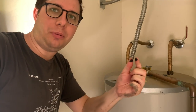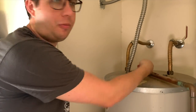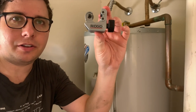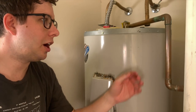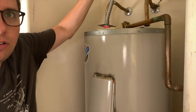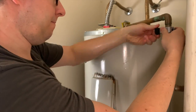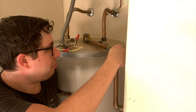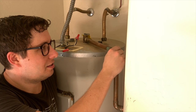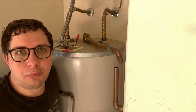You can see that O-ring crumbling there. The temperature and pressure relief valve is right in the center — you can always tell because it's got a little flippy part. I'm going to grab my pipe cutter and cut this three-quarter inch copper pipe off, trying to reuse as much as I can since the new water heater is about seven inches taller. My initial plan was to unscrew the top part — it's got male pipe thread, three-quarter inch — and just plug and play on the new unit, but it looks like I won't be able to get it undone after 17 years. So I'm going to grab a new length of copper and solder a bit more.